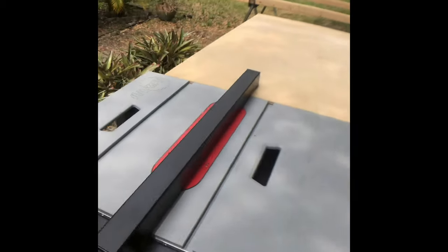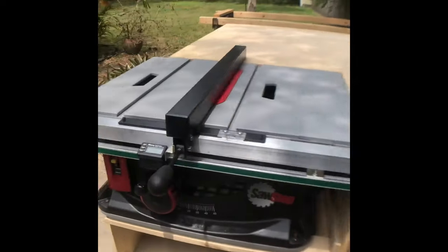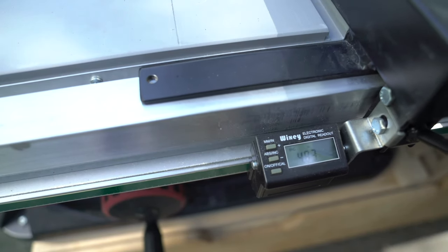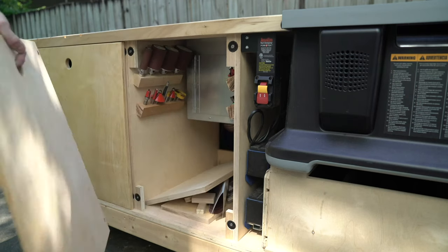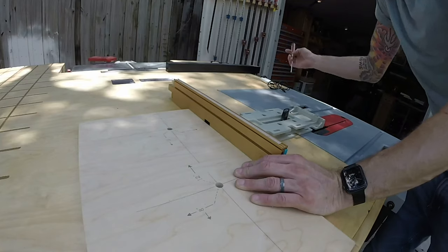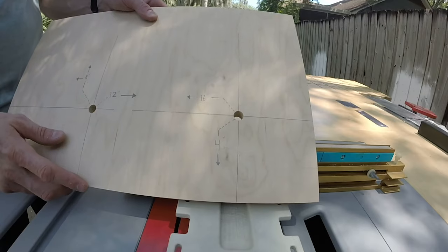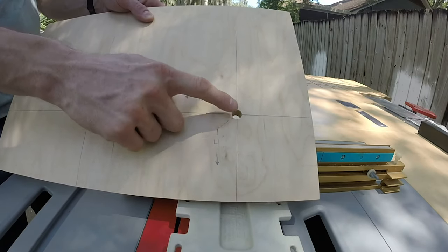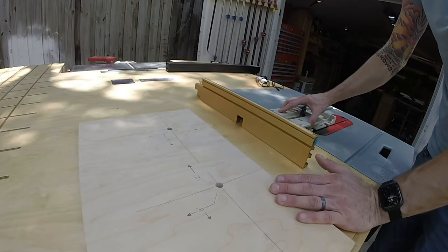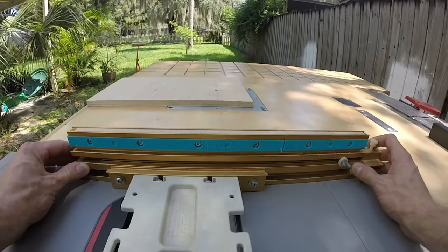The top needed to serve as my table saw feed, router table top, joiner bed extension, and assembly surface — so I had to be strategic about tool placement. Since the table saw is a job site saw with an extendable wing, the fence was limited to the saw's capacity, and I needed about twice that. So I fabricated my own fence rails and bought an aftermarket T-square style fence. I also got a digital fence scale I hadn't been able to use yet — it seemed like a good opportunity. The router sits right behind the table saw so I couldn't have a permanent fence there, so I put zero play miter stops on the Incra fence and secured it to the miter slots on the table saw.